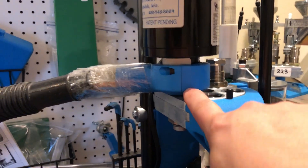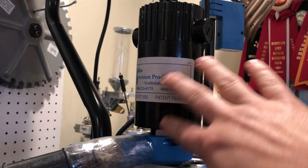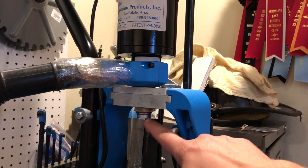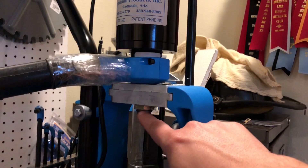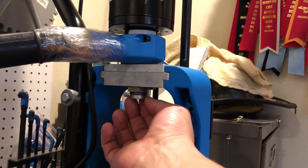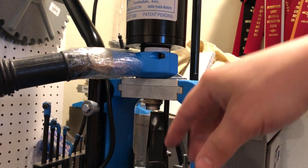A couple pulls later we're at the full-length sizing and trimming station — both done in one step. This is a Dillon setup with the RT1500 trimmer. The full-length sizing die is specific to .223 caliber; when you buy the trimmer and die together you have to tell them what caliber it's for. The sizing die on the bottom bumps the shoulder back and compresses the case into SAAMI specs. You adjust it just like any full-length rifle sizing die: screw it in, case check, make adjustments until it's acceptable, then lock it down.